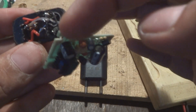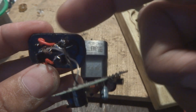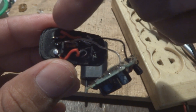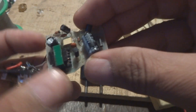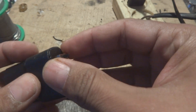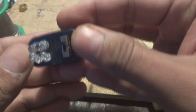The negative black wire from the power supply goes to the junction of the two LED pairs at the center point. The positive white wire goes to two resistors in parallel, then to the midpoint of the switch. One side of the switch connects to the red LED pair and the other side connects to the green LED pair, with the outer nodes as positives. I will now put this into the casing and fix it with a drop of glue.